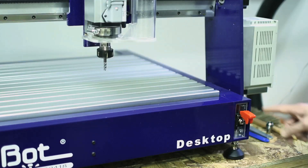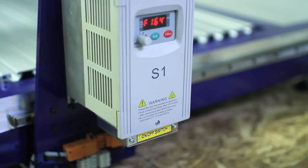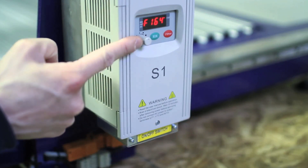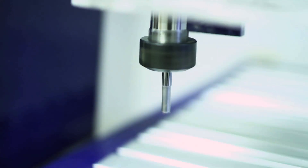Because the machine is driven by software, there are only a few physical interface components on it. The most obvious is this red cap power switch, which also doubles as the emergency kill switch. The second, for spindle-equipped machines, is the spindle's control box — it's got an on-off switch and a dial. You'll use this dial to set the speed of the bit before you run your cutting file. If you've got a router-based machine, you'd set that on the router itself. We'll get into how to determine appropriate speeds later on.